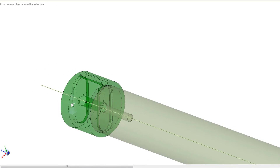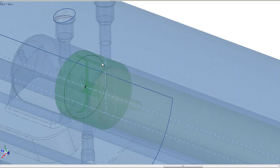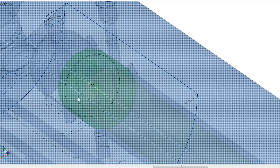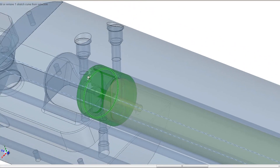The only way to practically do this is to support the drill as it goes down through the side of this hole on each side for these two drilled holes — otherwise you could never do it. Because this 1.4-inch diameter is already drilled up to around this depth, there's just no practical way you could drill those holes in there. So I've got to sacrifice this little piece on every part.